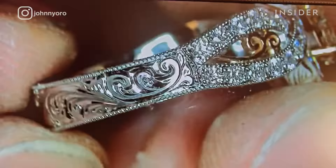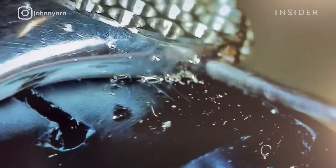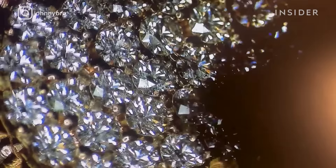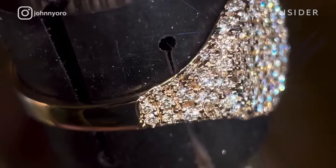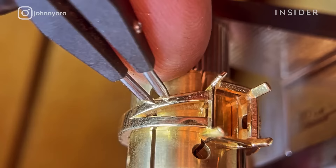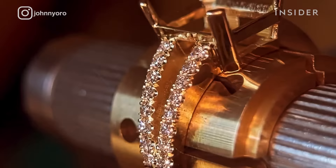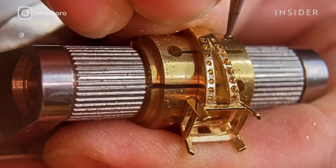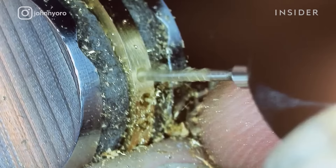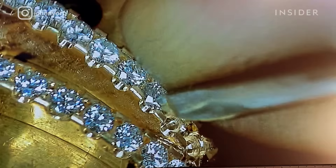My favorite kind of work is when I can incorporate diamond setting or stone setting with hand engraving together. The most important thing is to make sure that the diamonds aren't going to be damaged by each other if they're touching. When I'm drilling for diamond seats, I want to make sure that it's a very tight fit and it's going to fit like a glove. What you're seeing me do here is scribe out the location of where all the diamond culets — the very bottom point of the diamond — will go. After that, I follow up with a drill bit and a ball burr to create the diamond seats.